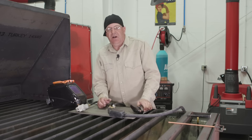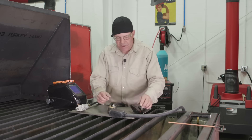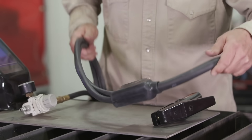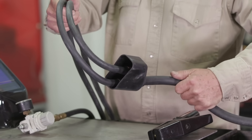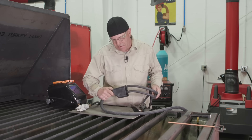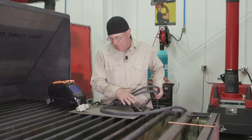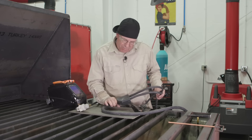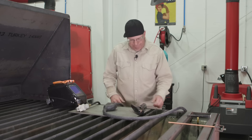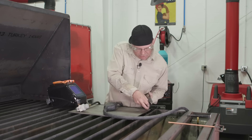Remember, I said this is electrically hot all the time — meaning if I had an electrode and touched a grounded piece of metal, it's going to arc and spark. That's the beauty of this insulated shoe here. I've been out in the field and had to cut an old glove around a TIG torch rig. Both leads being electrically hot on this exposed fitting are now covered by a nice robust insulator that slides up over and protects them, so if I'm up working high somewhere it's not going to get grounded out.